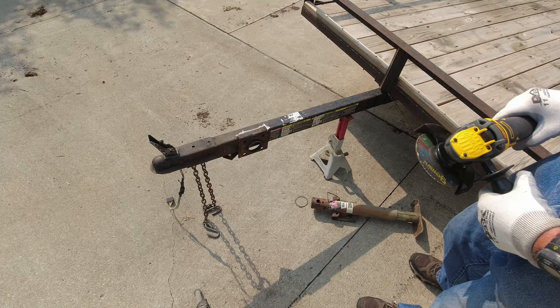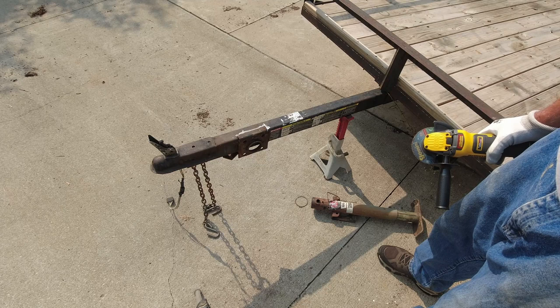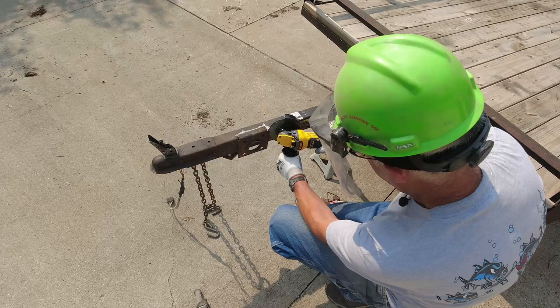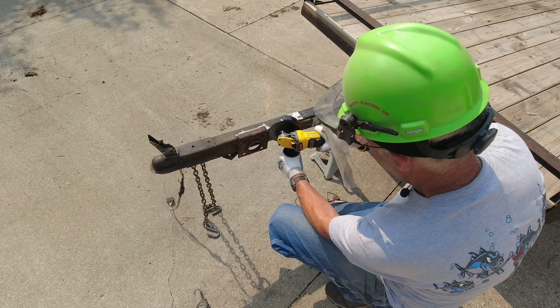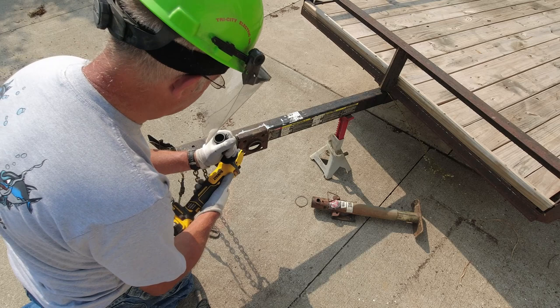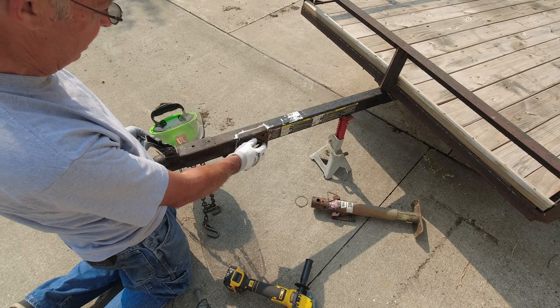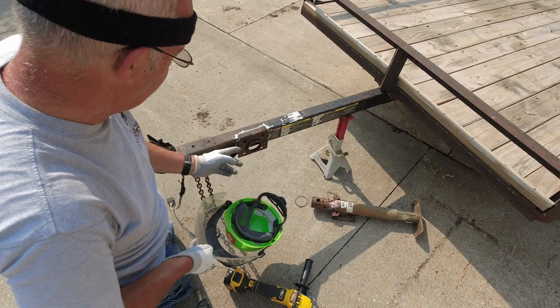The old jack was held on with a snap ring. I took the snap ring off and did a little grinding on it. Now I've got to do some more. Fortunately, they did not weld it on the bottom, so I don't have to stand on my head. And no, that is not a Harbor Freight jack stand. When they welded this on, they left a gap down here, and there's a weld bead that goes way back in. I think I'm going to have to get a cutoff wheel to get back in there. Otherwise I'm going to have to grind all kinds of stuff. Worst comes to worst, I'll get the plasma cutter.